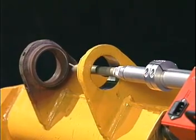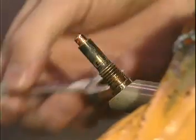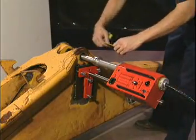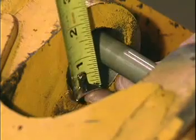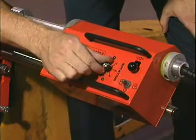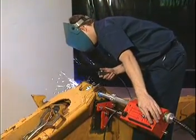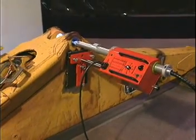The torch and wire feed conduit are then put in place. With the welding wire fed through to the torch, the nozzle and tip are assembled and the system is ready for final adjustments. Measure the depth of the bore, then adjust the torch length to allow for adequate travel. Determine the diameter of the borehole, check it on the cheat sheet on the face of the unit, and set the appropriate rotational speed. The Boa is ready to go to work — hit the weld switch and the rotation direction switch, then step back and watch as the Boa lays down a smooth, even weld surface.